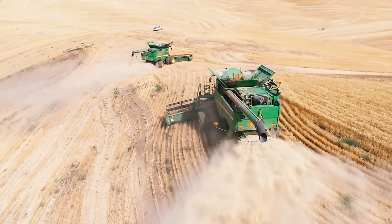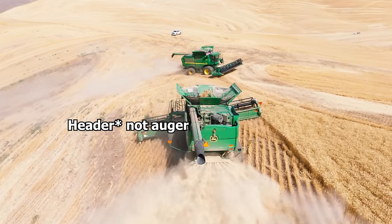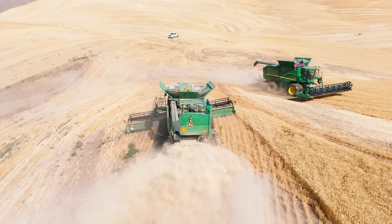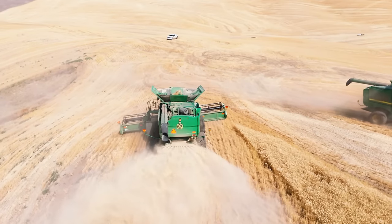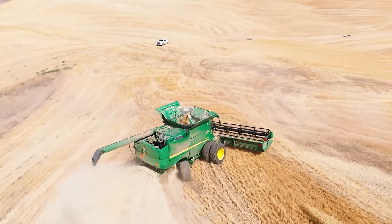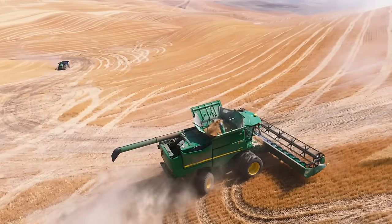And they made it. Made it and still got an auger full of wheat. That's pretty impressive. These John Deeres are staying up on the hill pretty good, but when you start sliding, you start tapping and holding your uphill brake, and that allows you to stay up on the hill better, because that uphill gets light, so it starts being faster than the downhill and you'll start bouncing. So just slight pressure on that uphill brake will stop it.